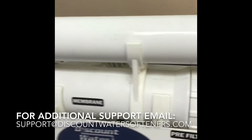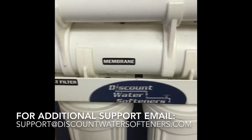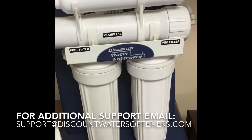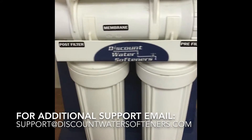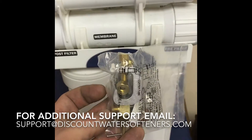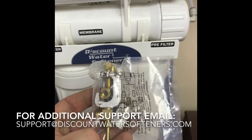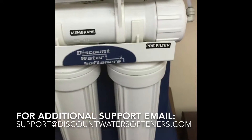The quarter inch tubing is the smaller tubing — in the color-coded version it is either blue or black. We typically like to install the blue line there because it's for water coming in, and that goes back to your saddle valve, which clamps onto your copper pipe. It's a self-piercing saddle valve where you tighten it down and it pierces the pipe.